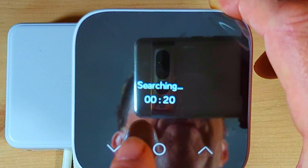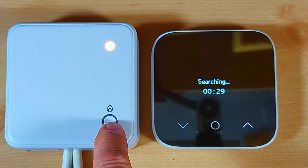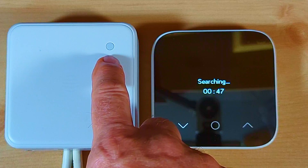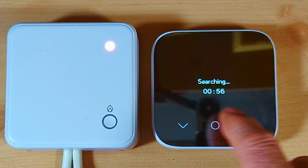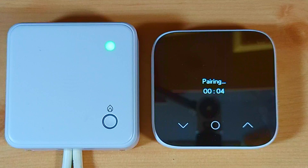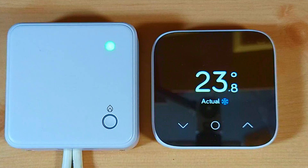To put the receiver into binding mode, press and hold the button on the receiver for 10 seconds. The light will change to a different flash pattern — one second on, one second off — in a purplish-white colour. The thermostat continues searching, and as soon as the light goes green it's paired. The screen shows 'Pairing', then 'Pairing Successful'. Now the thermostat is all ready to use — no hub, no Wi-Fi, no smartphone — just a basic thermostat controlling your central heating.